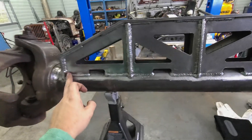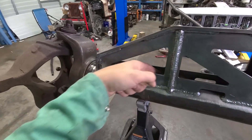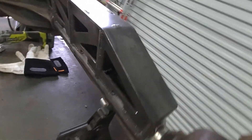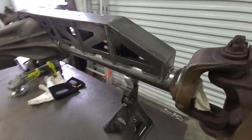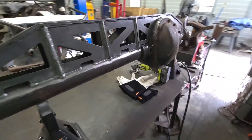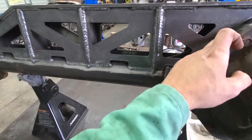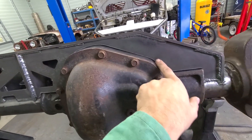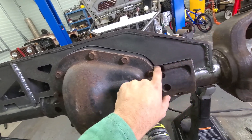I got the rest of everything welded all the way down. I even hit a couple spots on the inside where I could reach, just a little bit extra — both sides, front and back, all the way around when I welded. Now I've got to heat that diff up and weld up around here. I'm probably going to weld this piece around this corner and down to here, stitch it kind of, and do all of this as one solid piece.